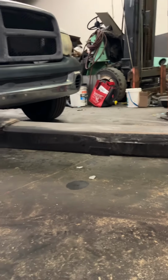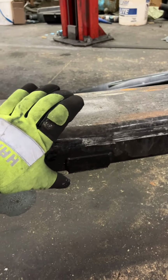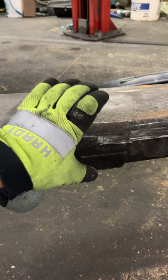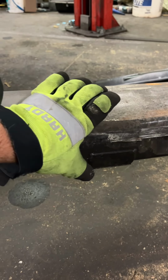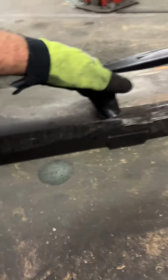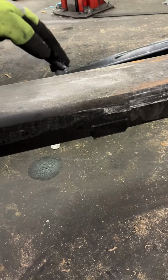So when you're pushing the wheel lift out from the other boom, the outer boom, this is the inner one, the other one's the outer one. And now when you're pushing the truck out, it's sliding like this, okay? And until you get it all the way out, this portion is at the very end of the outer tube. And now you have all the weight of that truck on this. And if you're loaded, it's even more weight. So what happens is it's bent.